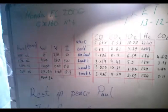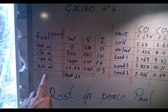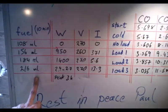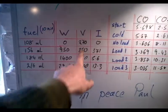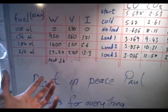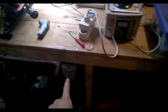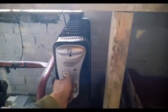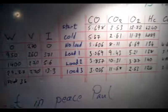Over here on the whiteboard we've got some preliminary data that I took - there are a set of videos for this that I already made. This is how much fuel we used in a 10-minute run producing this amount of power when it arrived. This little screw here is part of the original governor system - it was set too high as a factory standard and it's knocking out more voltage than it's supposed to, producing overcurrent and overrunning. What I did was use the heater and set it through minimum, zero load, one, two, and three. I took it down to a garage, had emissions tested, and we got results under the various loads.